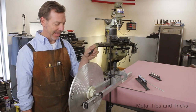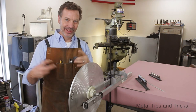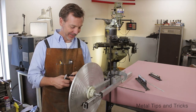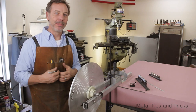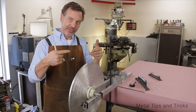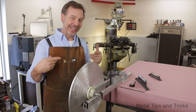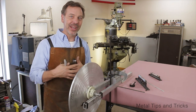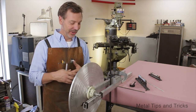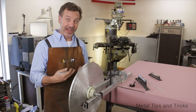It is about this glob of tape. I do not think that is going to affect the entire sanding machine. Because when I had it on the lathe, when it was out of balance, just sitting between the centers, it would fall to the heavy side. Well, before I took it off the lathe and already turned it down, I checked to see if I could find a heavy side and I could not.